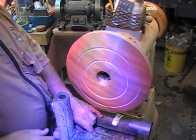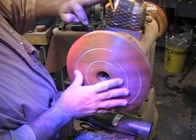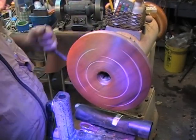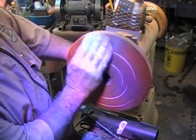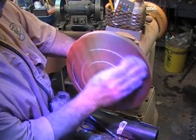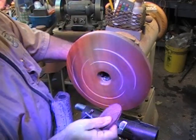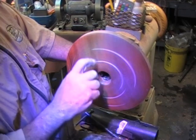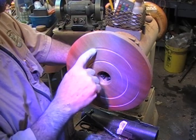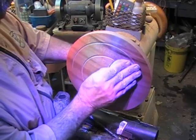Now, I would put this back on a flat plane. Go ahead and buff it back out again. Now, this time, I would just go to the grain, buff, and I don't want to remove too much of the sealer. I sure don't want to sand it out, because if I put a color in here, I don't want the color on the face.